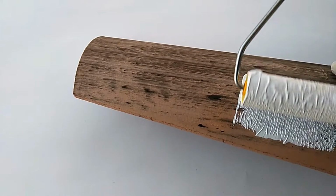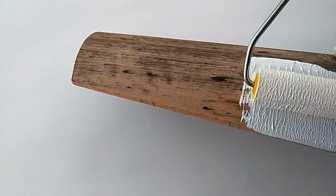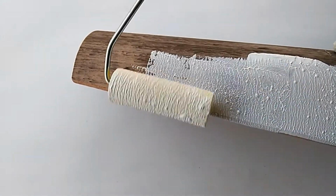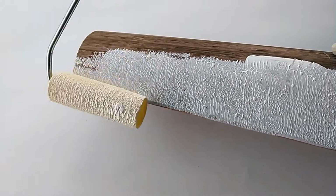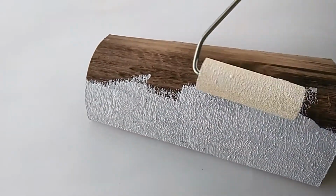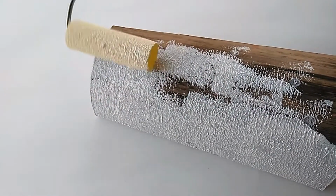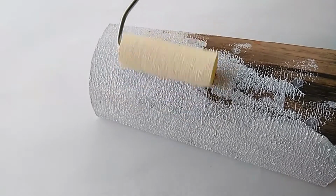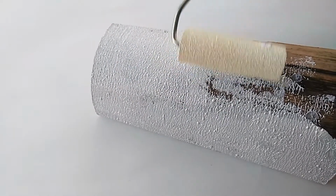We are applying the primer following the curvature of the tile. In this way we favor a better finish. The primer consists of two coats. This is the first coat, to get a good grip on the support. The next day a second coat will be given, which facilitates the grip of the technical grain with which we are going to cover. Remember that the primer is the basis for the system to work perfectly.